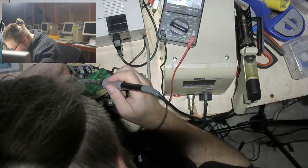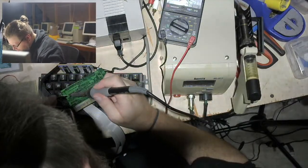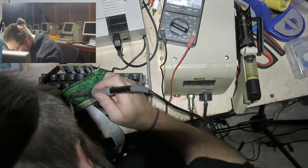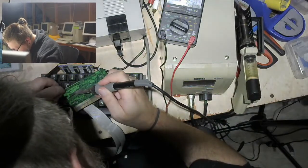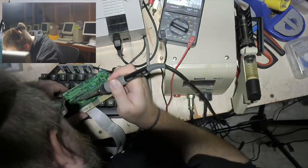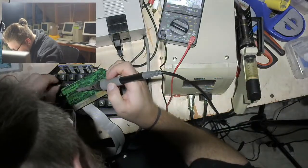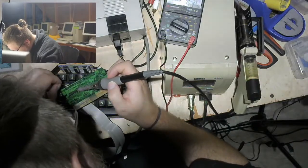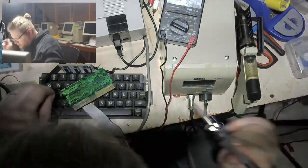And then there should be some other ones up there. Because the write enable, of course, I want to always be high, so I could just wire that one to high, so maybe that shall be the next one I steal. Yeah, that might be the one that I messed up the buy on a little bit. Whoops! Well, we'll find out when we try using this SRAM. Remind me to do a memory test later when we actually start using it for basic things, which thankfully I don't have to worry about too much because that will be ages from now. Absolutely ages.